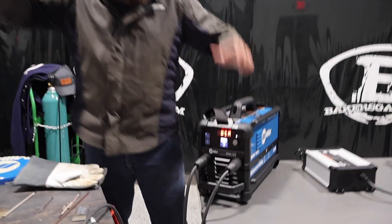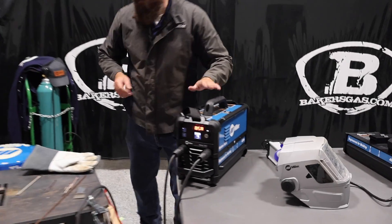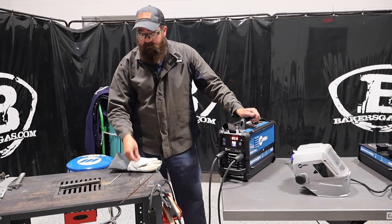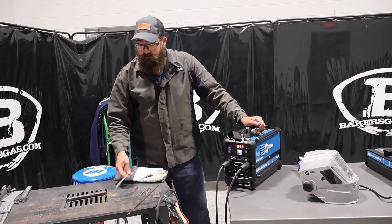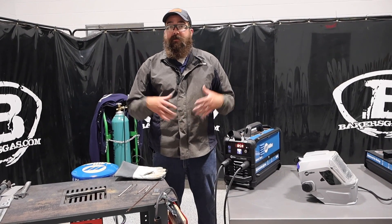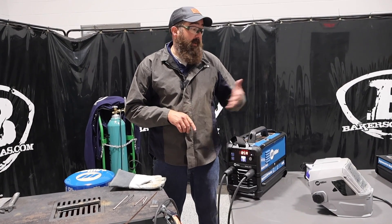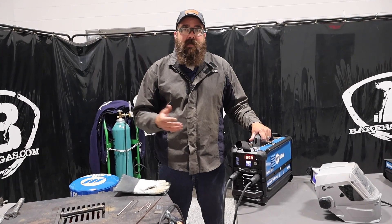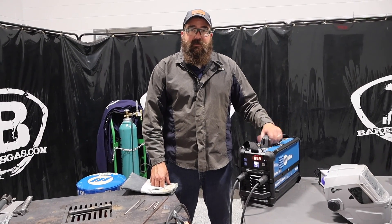We only lost 5% on the battery — that was one stick electrode, so not too bad. Like I said, you can get about 13–14 at 3/32 6010, and about 8 at 1/8 inch 7018. It ran super smooth. Check down below — we'll list all the packages and bundles, and we offer a discount on a secondary battery. If you've got any questions or comments, leave them down there and we'll do our best to answer. Thanks for watching and stay tuned for more.